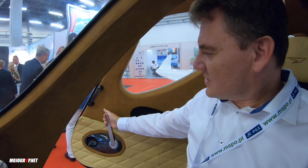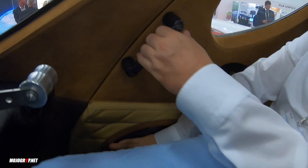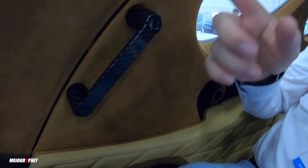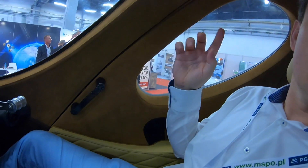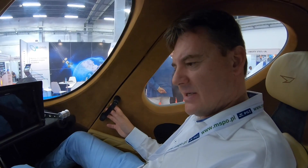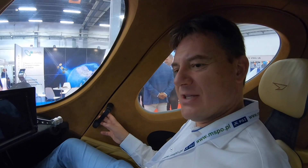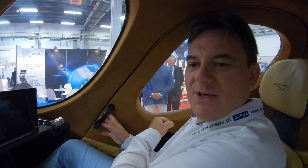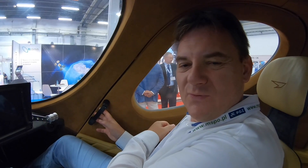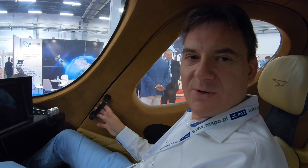In terms of doors, you can see that they can easily be closed, but the hinges are only there to place bolts — several bolts which are aligned along the door edges. All those bolts are to secure the doors in a closed position, as the cabin is also prepared to be pressurized, and by the pressure of the air inside the aircraft the doors will be pressed outward with a huge force.